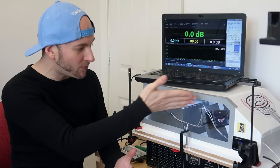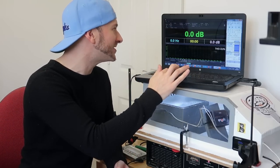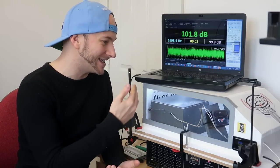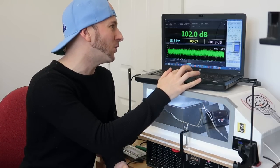Let's start off with open doorway, as always, 25 scaled hertz being at 150. This should be pretty loud because this is right on the horn loading frequency, and it is the cabin Helmholtz mode as well. 15 watts has been calibrated on the watt meter. Let's hit it and see what it does.